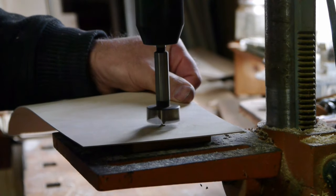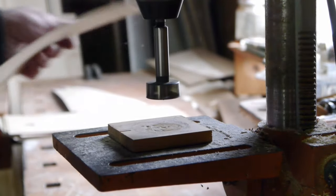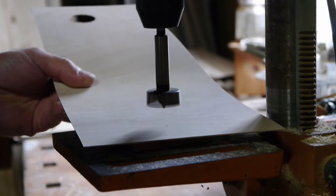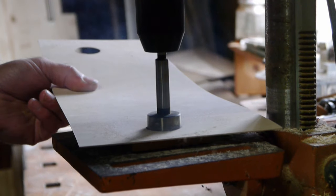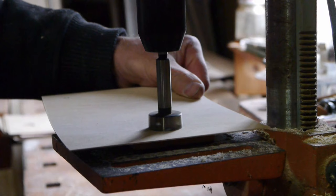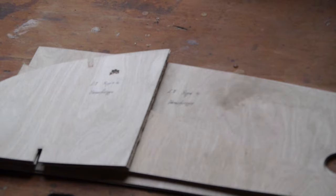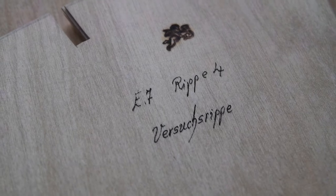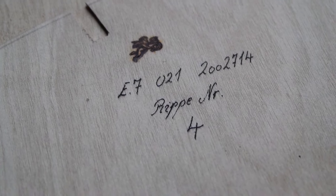The plywood cross pieces of the V40 are made of one millimeter thick plywood, which is made of three layers of veneer. These three layers of veneer would tear out if you simply drill through them. Therefore, only cuts are made on each side until the part falls out. Initially, only test ribs were built for both aircraft. These test ribs are used for load tests to prove that the resin we used — in this case a product from West Systems — is more suitable for the intended location than the Aerodux otherwise specified by the Federal Aviation Office.